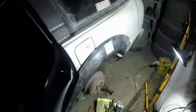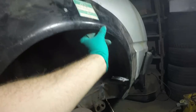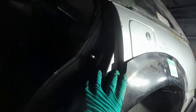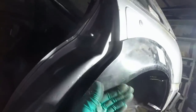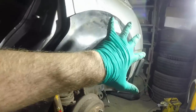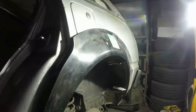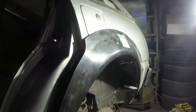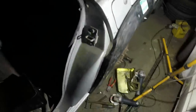So what I did was tack the inner wheel well in a couple of places, then offered the outer wing up. I've aligned it with the scallop thing at the back, clamped it in where it wants to sit, and got the curve about the same height as on the other side. But down here it's a bit too long, which means the whole panel wants to go up or rotate backwards a little bit. I'll try moving the whole thing backwards and ignore where that seam is for the moment. What it's telling me is that the inner wheel well is about right where I've got it. One bit that concerns me is just how far off this wing is sitting above here.